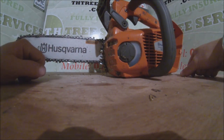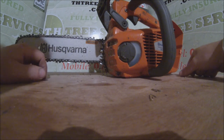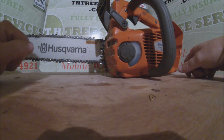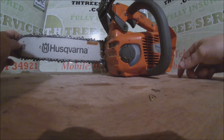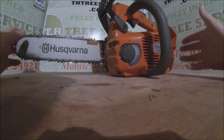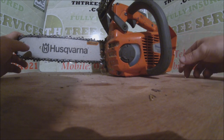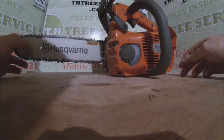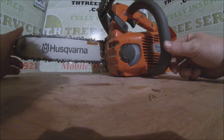Versus a petrol saw, all day long I think it's far better. I was skeptical — I thought the power was not going to be quite good, thought it was a bit of a gimmick. But since I bought it, I've realised they're not a toy, they're not a gimmick — they are a proper professional tool. But like I've said, it's a pruning saw. I use it for takedowns, but for a big takedown once you start getting down to 6-inch-plus diameter, you need to switch over to your petrol top handles. They also do a rear handle version — the 536 LIXP without the T — which we have, and I think that's brilliant as well. Same engine but it just feels a bit more powerful; the rear handle helps you dig through the wood a bit better.